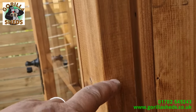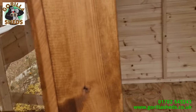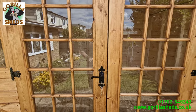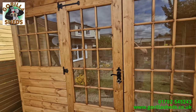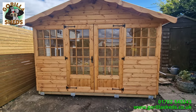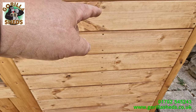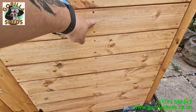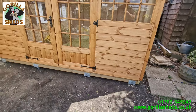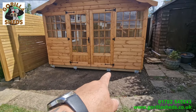The doors are 45mm thick and 95mm across. This is the standard horticultural glass we've put in this one, but we can upgrade to 6.4mm laminated safety glass — it's got the plastic running through it. Every plank is nailed top and bottom — double-nailed. We don't do it with just one nail at the top and one at the bottom like you see on a lot of sheds. The only exception is if there's a knot that doesn't allow us to put the nail in.